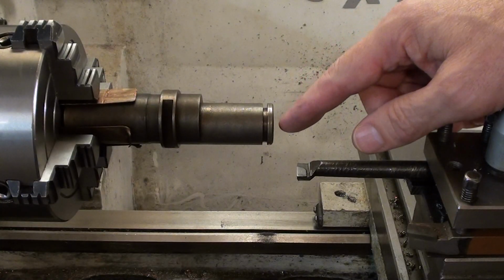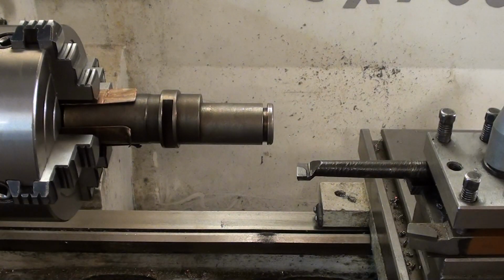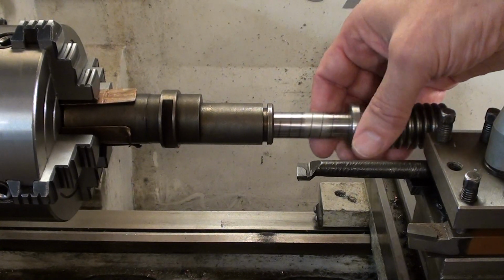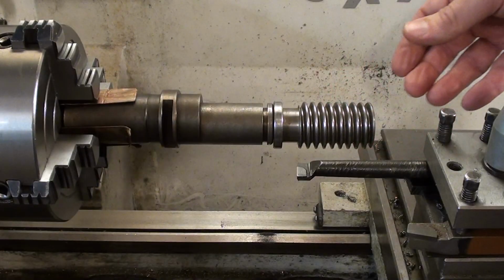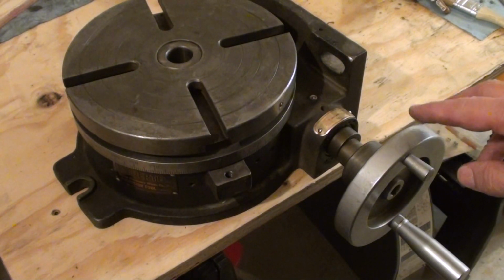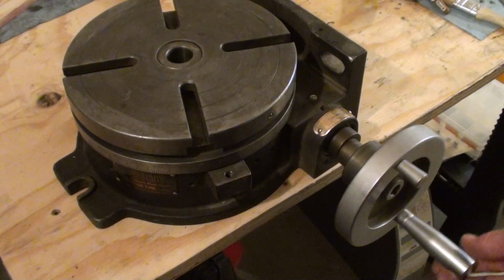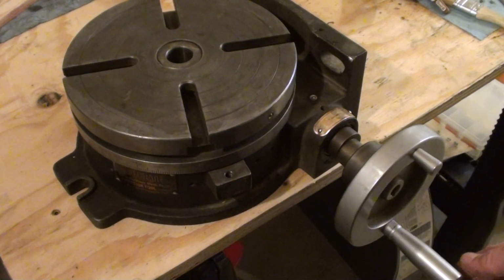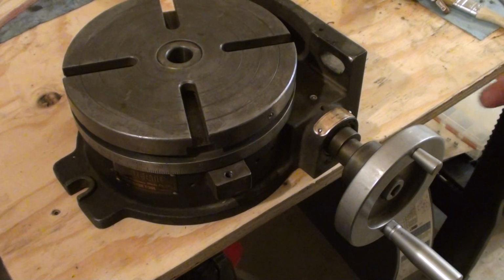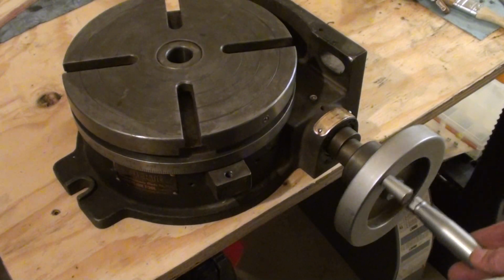So now I've taken about 7/1000ths of an inch off the side that's rubbing, I guess, and the shaft now fits. So there's the worm shaft, partially assembled. There's no thrust bearing or anything, but I just wanted to see how it works. And it actually works pretty well. There's no lubrication in there, and it's just nice and free. Cannot feel any play, but everything's loosey-goosey without proper assembly. So far so good. I think that may be serviceable, if not beautiful.